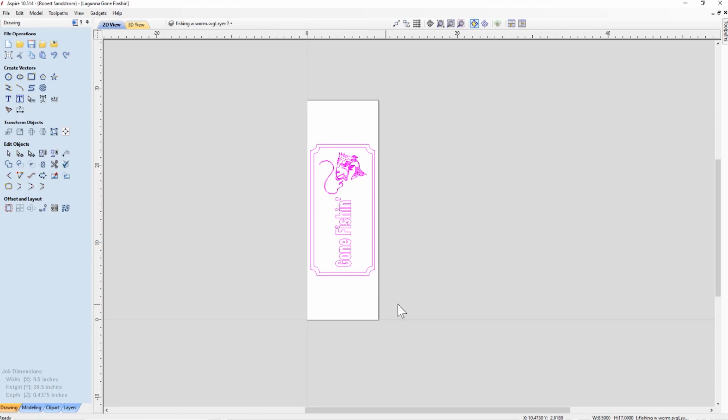It's only 7/16 inch thick. It's 28.5 inches long by 9.5 inches wide. We're carving in the up and down direction because we didn't want to cut the board down to the original 24 inches to fit on the Laguna IQ in the X direction, because it has plenty of room in the Y direction. And we're set now to continue on with the rest of the process. That's an advantage, by the way, because it gives us more hold down area at the top and the bottom. All right, so the next thing we want to do is start building the toolpath, or recalculate the toolpath.